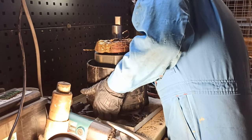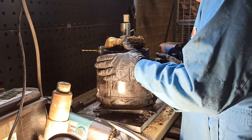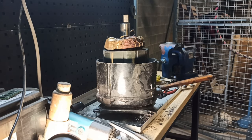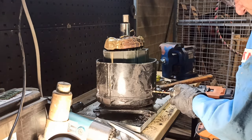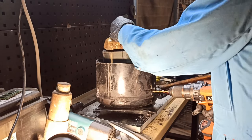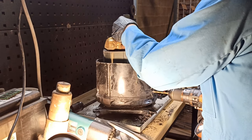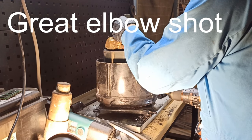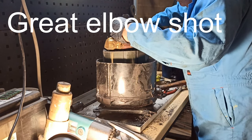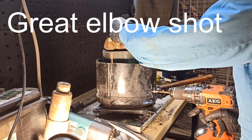And you need the drills, and luckily I have the drills. And so, let's have a crack at that. So that should be around about the middle, of course, because I've ground it off, and even there you can see it moving. Start with a pilot hole. Use a bit of drilling lubricant so that you don't ruin your drills.